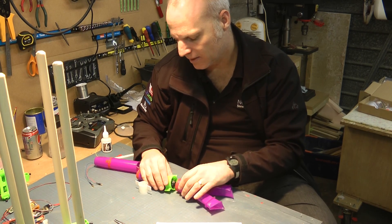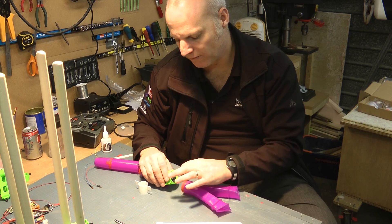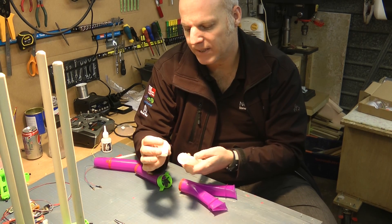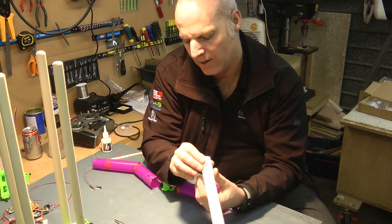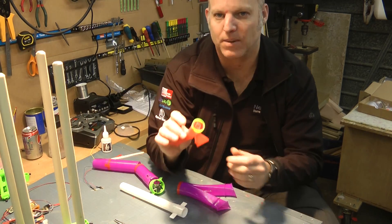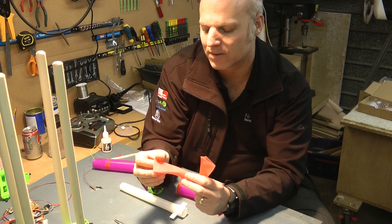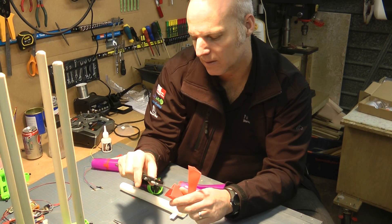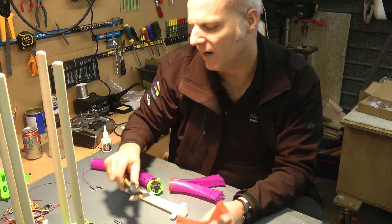I changed the way the fan couples to the inlet — I wasn't happy with the transition from the inlet into the shroud, I wanted a little bit of a flat on there just so you can line everything up perfectly. So here's what I came up with: that's your exhaust, and that's your shroud. Those tags will be gone, and that fits in there — job done. For the inlet, I've got one mocked up here. It's printed in three parts. The wall thickness is 0.35mm.